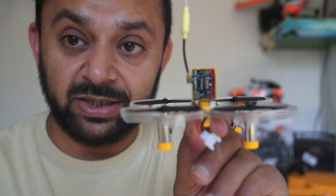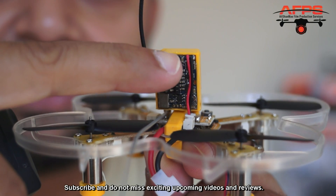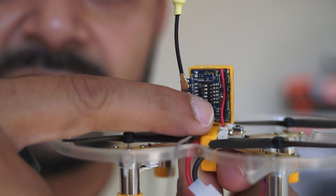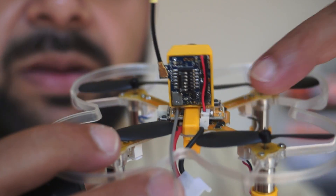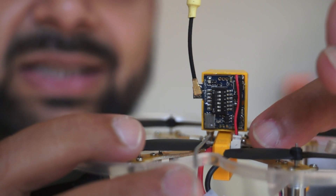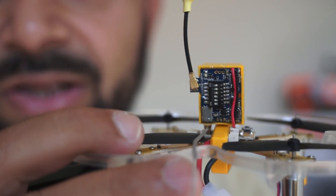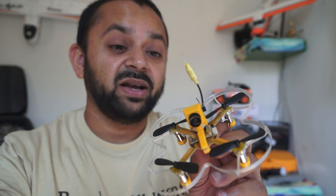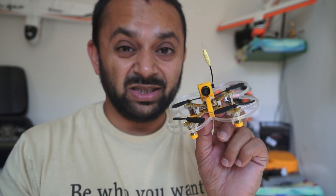Second issue — are they really trying to save money by cutting down on the cable length? Check out the length of this red-black cable that is powering the camera system; it is extremely tight. You can see the tension on it when you connect the connector down here to power the camera. Upon a little crash, if the camera tilts forward, this connector will come right off, or the soldered connections here will come off. These are really tiny, fragile connectors and sometimes the quality of soldering from Eachine is not that satisfactory.